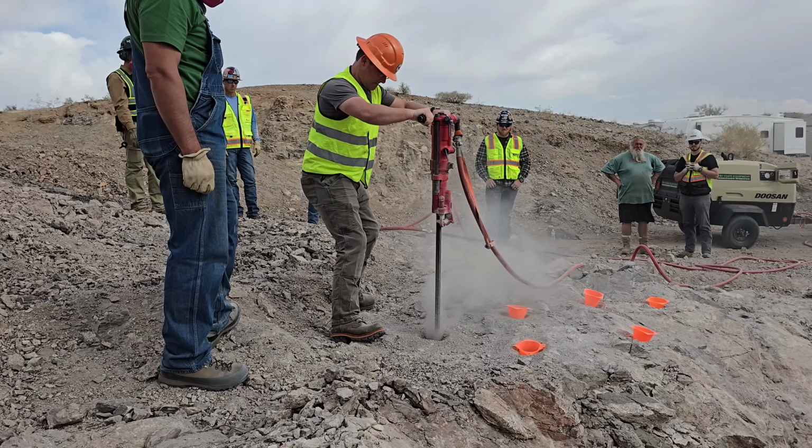So it's dual lays in the hole. Okay, give me a stick of dynamite. We're gonna put one stick down, and then we're gonna measure it. Oh, we've got lots of room. So we're gonna go to ANFO to here, and then we're gonna stem the top. Okay, get us a stick. So teamwork, we're gonna get this done on time. Down the hatch. Look at that. Beautiful.